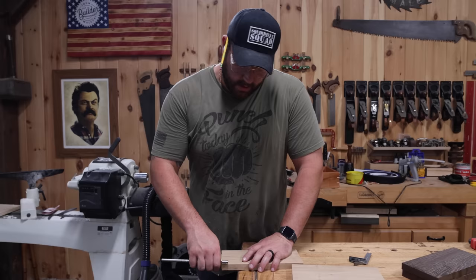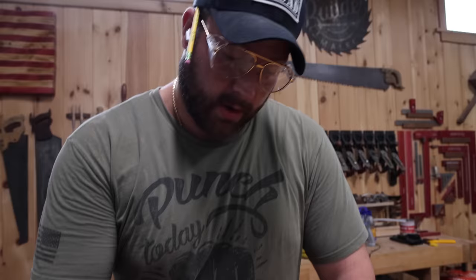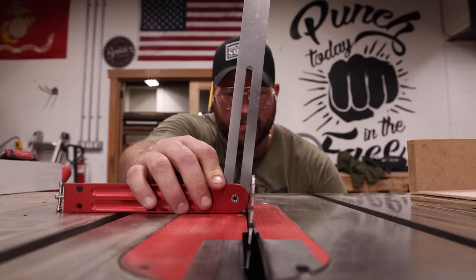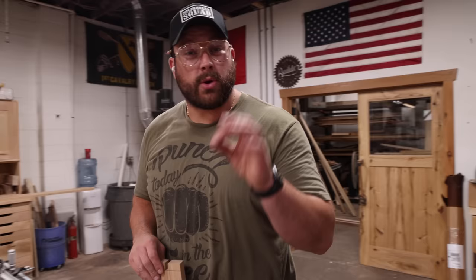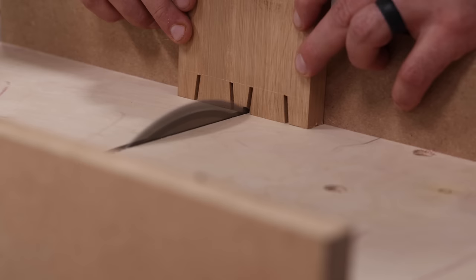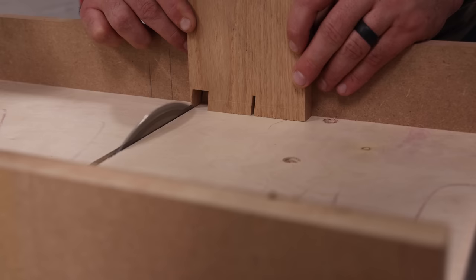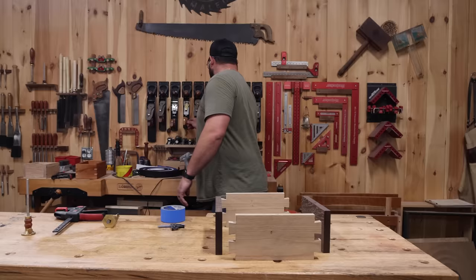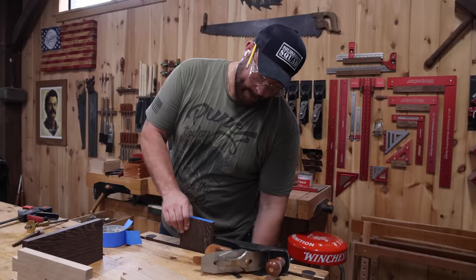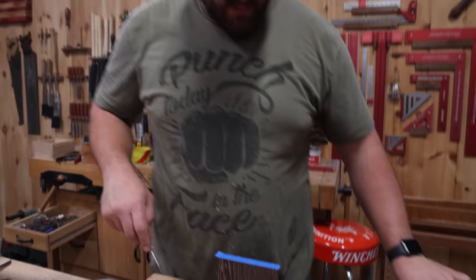Just under a half hour in. I'm laying out — it's going to be a pin board with a tail board, and I have this really cool seven-degree blade for my table saw that I'm going to use to cut the pins. I'll cut the tails and transfer those pins and cut them off by hand. I've got a specialty table saw blade that is angled that I can cut dovetails on the table saw — they'll be super crispy and it'll speed things up. This is the Mike Pekovich technique for dovetails. He uses this blue tape, which especially on this dark wood gives me an opportunity to really see where my lines and cut marks are going to be.